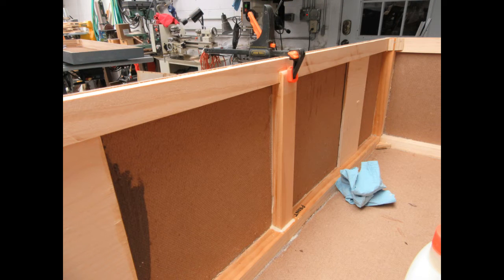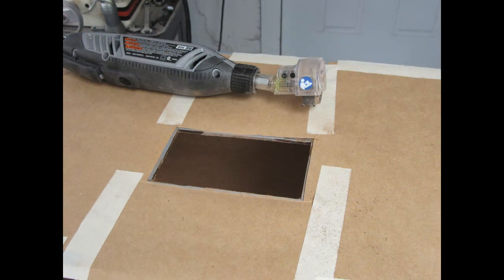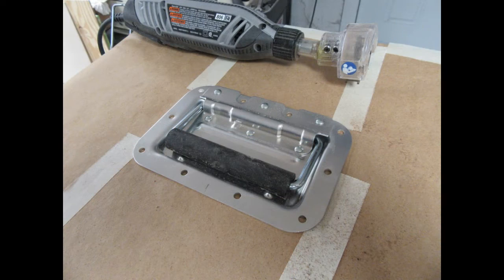Since this is a larger case, the masonite panels can act like the head of a big bass drum. To dampen this down, I add a stiffening rail in between the two latch reinforcing panels. It is formed and attached just like the hinge rails. It is time to make the panel cutouts for handles and latch hardware. The two handles on the case ends are centrally located, and here I use a Dremel microcircular saw attachment to make the cutout on the masonite, followed by test fitting a handle.